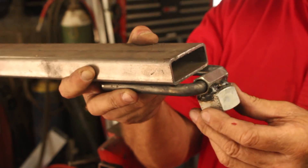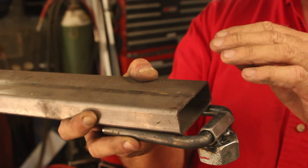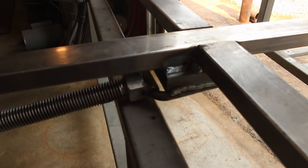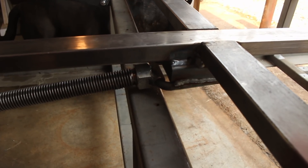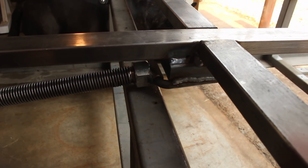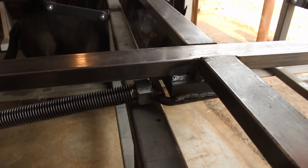Here's my anchor point - I'm going to weld it onto this piece of tubing and then weld that onto the underside of the middle of the table. Here it is installed, and something has come up: it won't go as low as I was hoping because the nut is hitting the frame. I may notch that out if I need it to go lower, but we'll see what size slab fits on there when we put the gantry on.